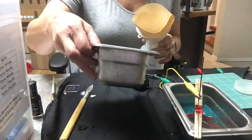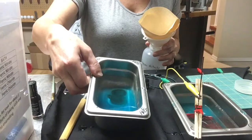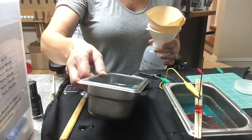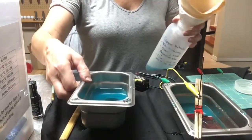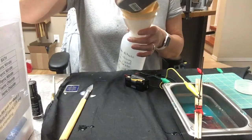I'm going to pour the solution from the Argentium pan — you can see there is a black bloom on the bottom, that's the copper, and it looks like not too much silver has been etched out. When silver starts to etch out you get that sludgy stuff. Just double-filter a cone funnel and then pour it in.